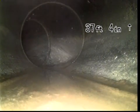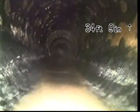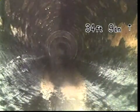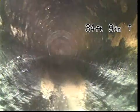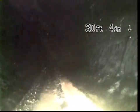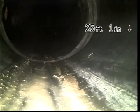Normally they'll come 10 to 12 feet back in from the curb, and that's where this clean out is. But isn't there a period of 18 inches of cast iron past the clean out? We're 18 inches before the clean out, and then it drives down. So they'll open a hole there or close to that point, and whatever cast iron is there, they should replace. Or they figure that the passage through the old pipe is good enough, and they might just line it. Exactly.